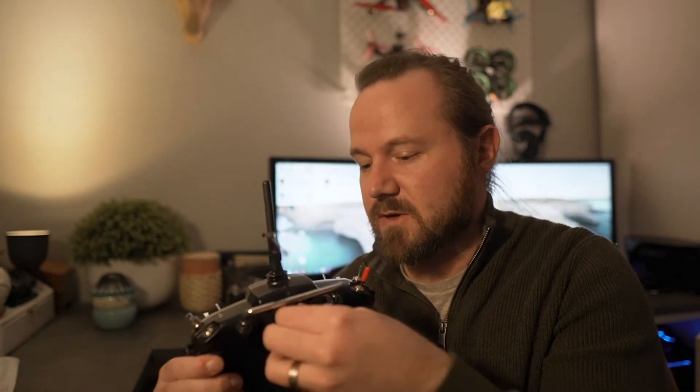When you're first getting into FPV, one of the first things you're going to buy is your transmitter or remote control, and typically you're going to be running off the inbuilt antenna — the internal RF — which is fine, but there are better ways to do it. Enter crossfire. This particular transmitter, the X9D, comes with the inbuilt antenna and a little area in the back where you can plug in accessories like the crossfire module. Not all crossfire modules look the same — this is the one I have. It just clicks straight into your Taranis and you're good to go once you set it up. Quick note: whether it's a transmitter, receiver, VTX, or whatever — don't power any of your FPV equipment up unless you've got the antenna plugged in, as you can potentially damage the gear. Just make sure your antenna is connected.